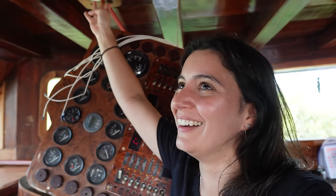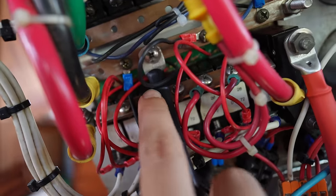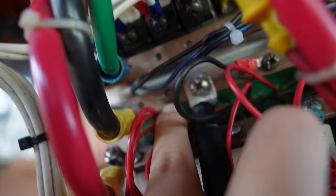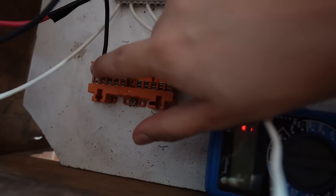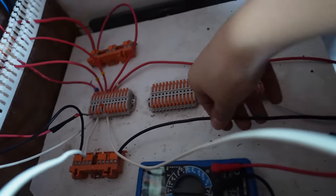I did something wrong. Okay, this is embarrassing. As the other lines were working, I assumed the negative was connected for all of them. This line here — the negative is here and it was connected straight to the power source, and of course when we moved the power source down it was disconnected. That's why it didn't work. This wire here is the one coming down from the links, giving negative to the whole panel. I put it in the same bus bar — you can see this black one enters here. I did a little bridge here and now this one is the pilot house light.